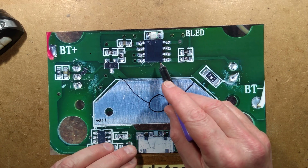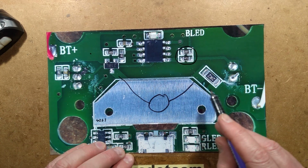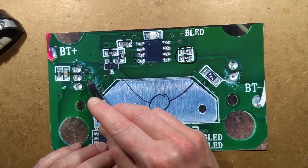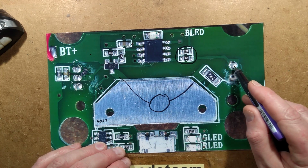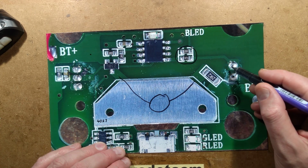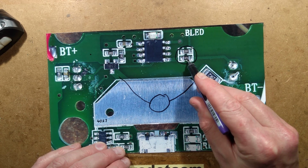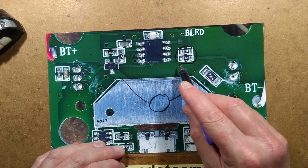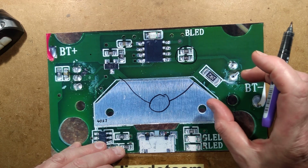The infrared function caught me initially, the fact there are two resistors here. When it wants to switch to infrared mode, it starts monitoring the input from this infrared device, but it also starts pulsing the output to this LED here, which is the infrared LED. It's got a 471, that's a 470 ohm resistor, and that limits the current through the LED, so it's not that high in the first place, and it's also being pulsed.